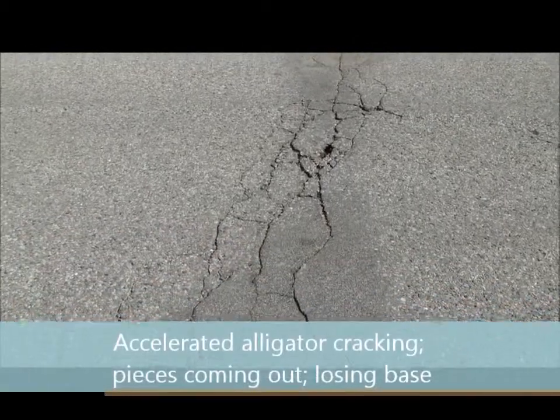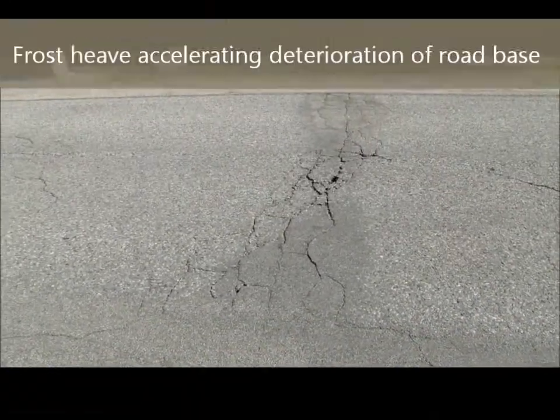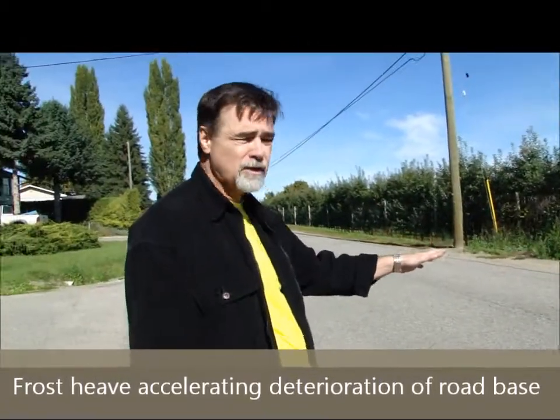So we're about 50 meters down the road, and here's another transverse crack. You recall the one up there that was treated — this one you can see a little bit of treatment too. It didn't take. The cracks continue to reflect through, and now what you've got is accelerated alligator cracking to the point where pieces of material are actually coming out. You're losing the base, the water's in. The cracking is now really accelerating the deterioration of the base. You really don't want to lose the surface, and you don't want to lose the base — losing the base costs a lot more.